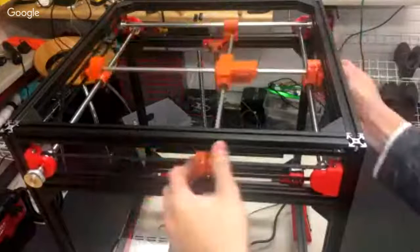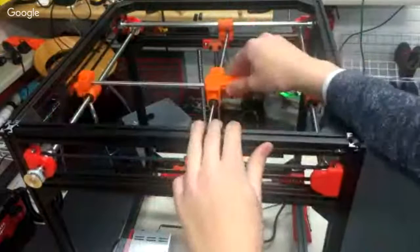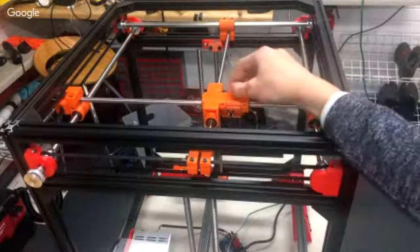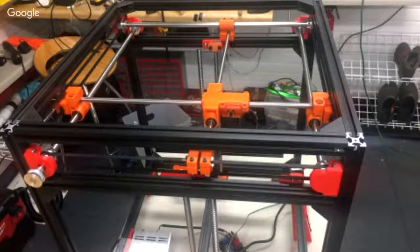The other thing is your bushings are brand new, so it's as tight as it's ever going to be right now. I was just saying they'll loosen up over time. They'll basically wear in because it's an oil impregnated bronze bushing on steel. So the hardened steel rods will be the thing that holds up, and the bushings will be what wear in.